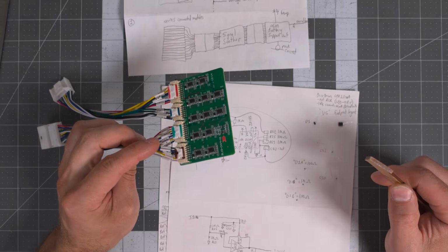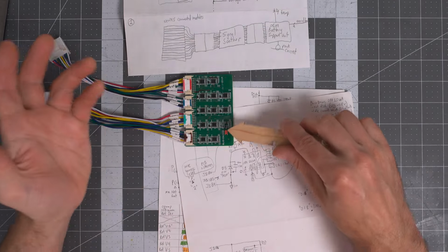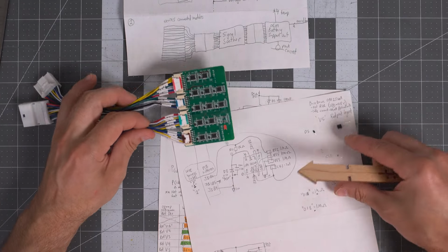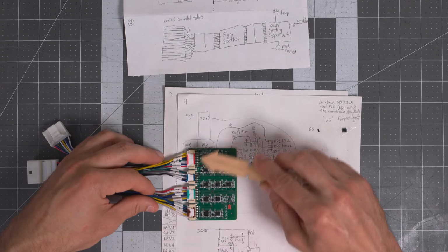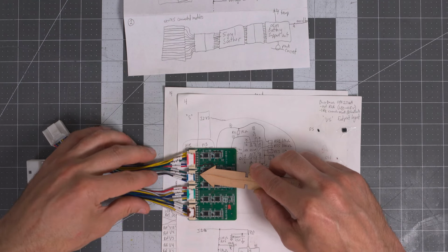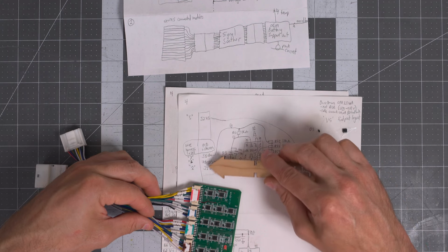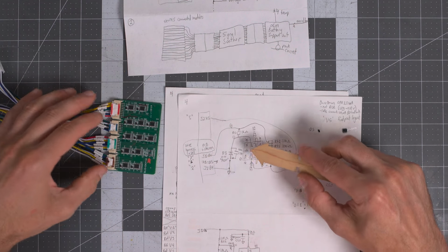So where are we going with this? I just picked V5 at random. So this is ultimately spoofing the V5 output, and that's here, J2, which is this connector, and V5 is the one marked V5 there. I've got it circled. This is the first one I looked at. And we are spoofing V5, but we're not looking at the battery 5, so that was kind of weird, and I definitely was like, oh, that's interesting. Let's look into that more.